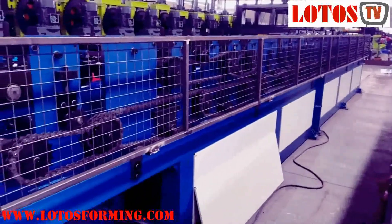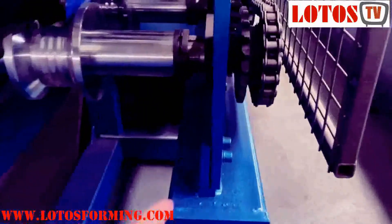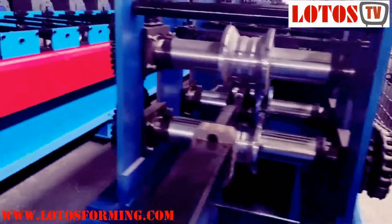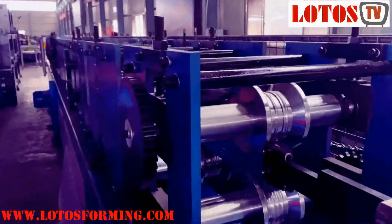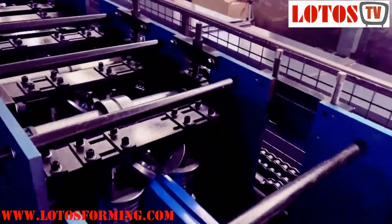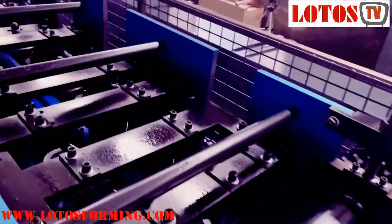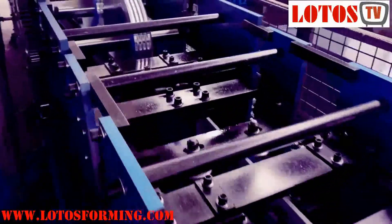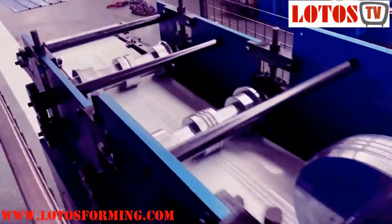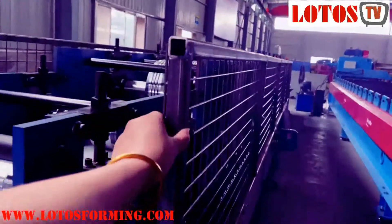You can see, compared with a normal traditional downpipe machine, even the structure — everything is different. Once we load the wall panel stand onto the structure, we put this kind of T-rail and L-rail, which helps much more for the straightness of the stands. This is how we unite the roller, vertical roller, side roller, and even on top of the machine. This sort of 3-in-1 machine — we have already uploaded several types to our YouTube channel. You may search and you will find the video. The input feeding table has a safety fence added on the side.